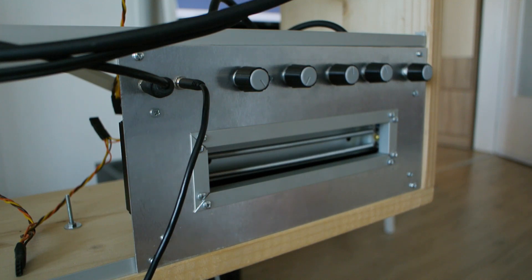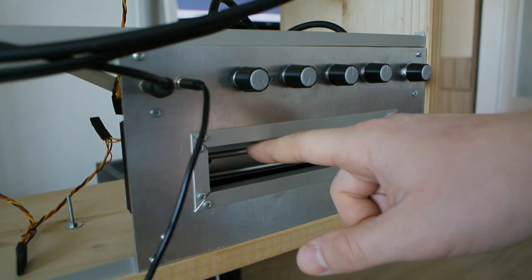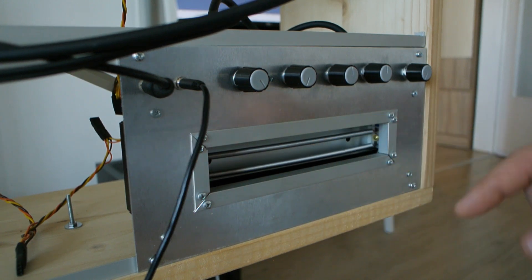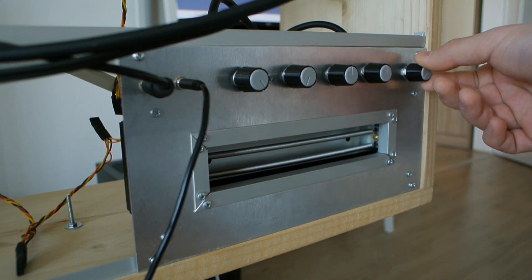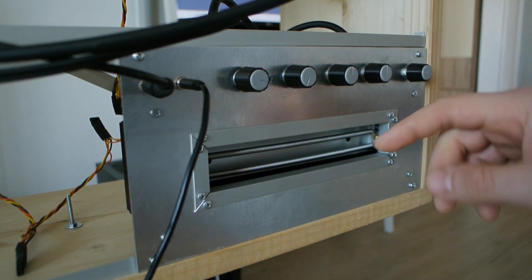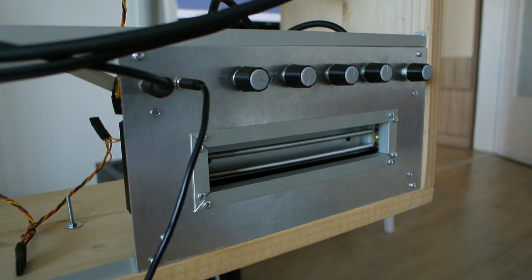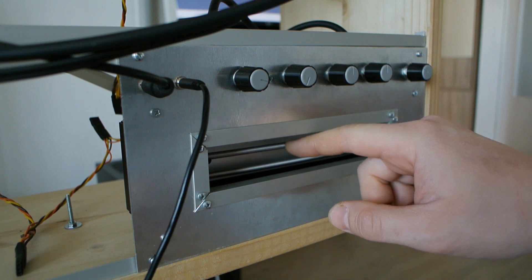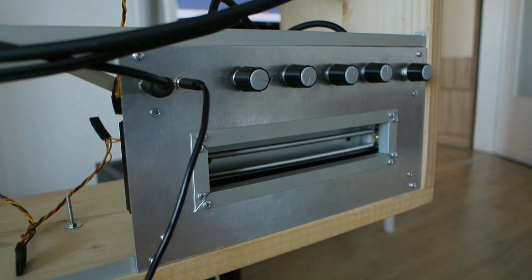Because of these clipping diodes, it's protecting the chips. If you adjust it just on the brink of self-oscillation and bang one string, it starts to self-oscillate. When you play music through the reverb, it's like the music is banging on the strings, and the strings start to self-oscillate — but they oscillate at a frequency derived from the signal, so it fuses the space with sound derived from the signal. That's why it sounds cool.